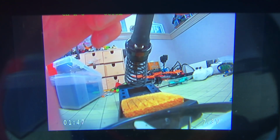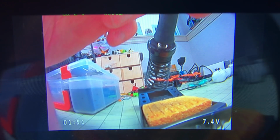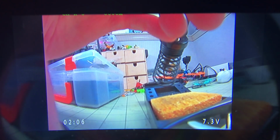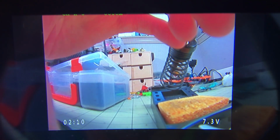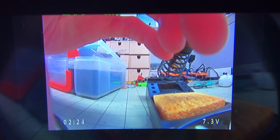We have powered on time in the lower left, and the voltage, see if you can see that better, in the lower right. So I am at 7.4 volts, where this battery was at storage voltage when I started, so that's just about right. Now it's not super obvious, but it's definitely better than nothing that I have voltage. I did also confirm the wires go on the top of the camera. With the OSD cable, you might be able to flip it, but for right now, I just go with the battery wires on the top.